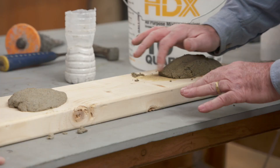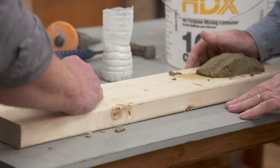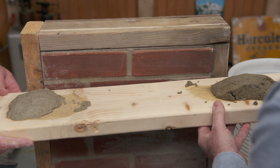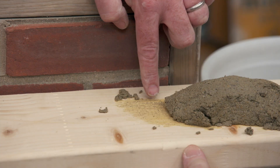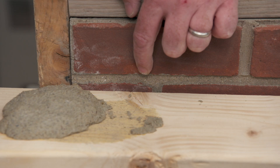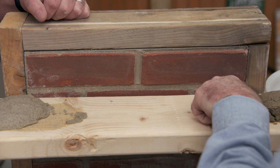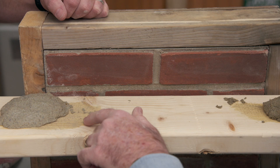As this little part dries out, it's going to get us close to what we're going to look at when it is dry. These are actually looking pretty good right now — let's compare it to our sample. I know that Portland cement before it cures actually has a green to it. I'm starting to see some green in my dried-up mix, and I'm starting to see a little bit of that green that turns to gray here. So I think I'm going pretty well. Now looking at you, right away I can see that gray is really starting to get light.